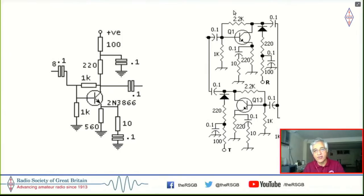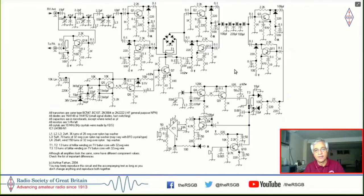So if you could make one circuit with these 1, 2, 3, 4, 5, 6 resistors and 4 capacitors, and get this amplifier going, then you strap 2 of them back to back, and that becomes a bidirectional amplifier. So this was actually the key block to what became the BITX. So this is the entire BITX circuit, and the best thing about this was that I could see the entire circuit. I mean, you can see the entire circuit on your screens right now and probably even read some of those values.